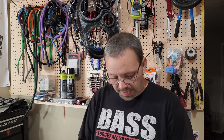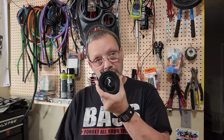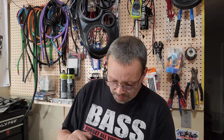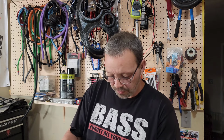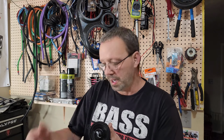So in essence, taking a speaker out of an enclosure is like attaching a high-pass filter. This is in essence a high-pass filter for this speaker, a physical one. Whenever the lower notes propagate, they actually manage to cancel each other out. As the frequency gets lower, once it gets to the point where it's here, it can cancel. So that's why you don't get any low notes.